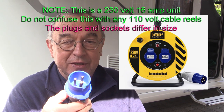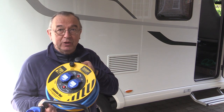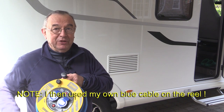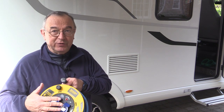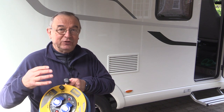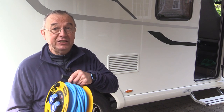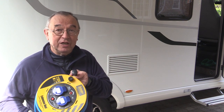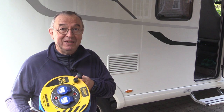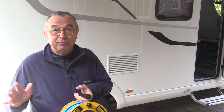It's a 16-amp supply, and the plug is a three-pin plug with round pins. With a cable reel it's really important that you unwind all of the cable. When electricity passes through cables it generates a small electric field around those cables, and if the cable is wound in a circle that field can cause a heating effect. If you've got a lot of cable wound on a drum and you're drawing large currents — perhaps running a kettle — that heating effect can be quite serious. So you must unwind all of the cable, and then there won't be a problem.